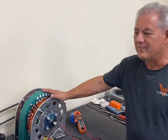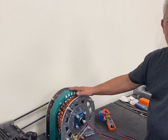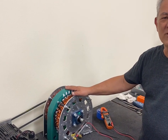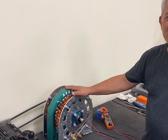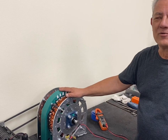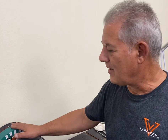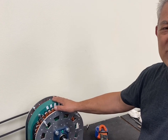The key thing I wanted to mention today is that this particular generator has a flexibility built into it where you can get whatever voltage or amperage that you're looking for by virtue of the way that we assemble it. So if you have a 240-volt, 480-volt, 600-volt, or 800-volt system, we can meet your needs for that. That's the designed-in flexibility with this generator.